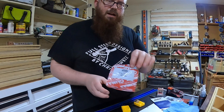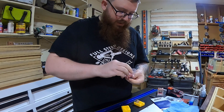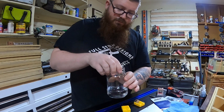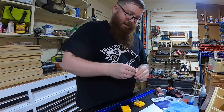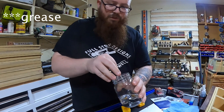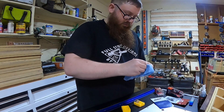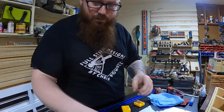When you get these collars, you'll notice they've got some oil or grease on them. I like to use a little bit of solvent and drop them in a cup to clean them up. I also like to clean off the shafts on my router bits because they usually have a little bit of oil on them too. Just get that removed, and be careful not to cut yourself on those bits.